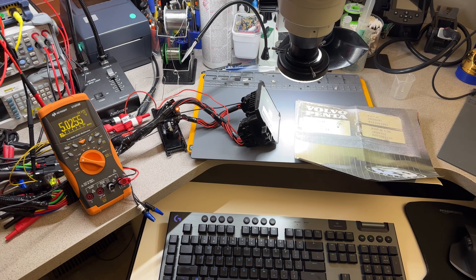So these are his serial information — his computer number is 401365 for reference. Right now I have the computer running and we can see this is the injector on bank one which is not pulling down to ground properly. I have the ESC signal which is steady, and then the TACH signal. This is just a fuel pump activation which we can see is completely grounded — that is good. But I can see it is reading injector milliseconds and it's working and not working.